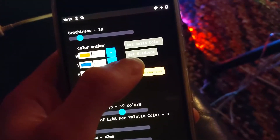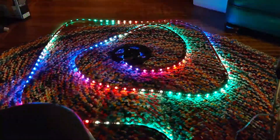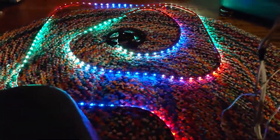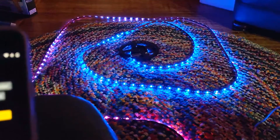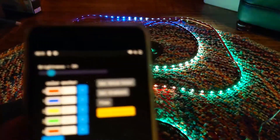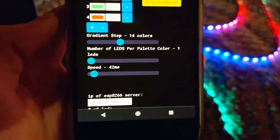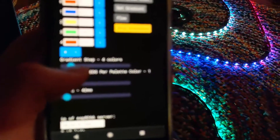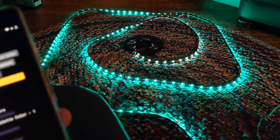The reason why I have all those fun little settings is because you can do this right here. The only animation I have is Flow. What it does is it increments through the palette. It's kind of a common thing with LEDs. Let's bring it down so it's smoother — my gradient steps are really fast. I'm going to go through those colors faster in my interval. My interval is currently 42 milliseconds, so it's animated really fast. I'm going to change my gradient down to one color, so I'm cycling through all 256 colors.